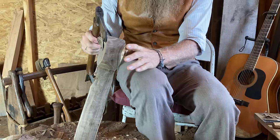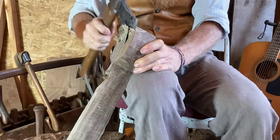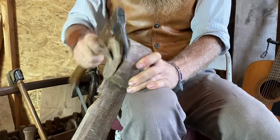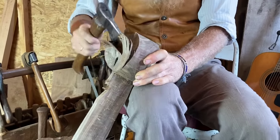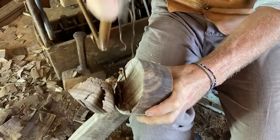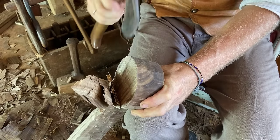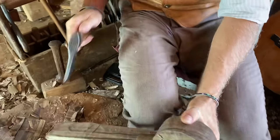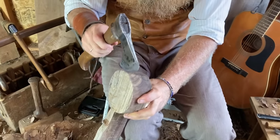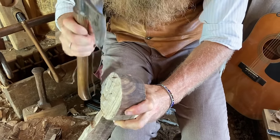This is a hard cut to make. Notice how my hands are way down on the sides, not on the top. Go slow on these chops — you're not going to get it done with one of them; it's going to take a while. As you carve the spoon each step gets harder and harder — the beginning is the easiest part; it only gets harder from there. Don't take wild chops and split your handle — that's why I'm leaving those curls to prevent that. You can see I made it down to my line; now I have to cut the center out.